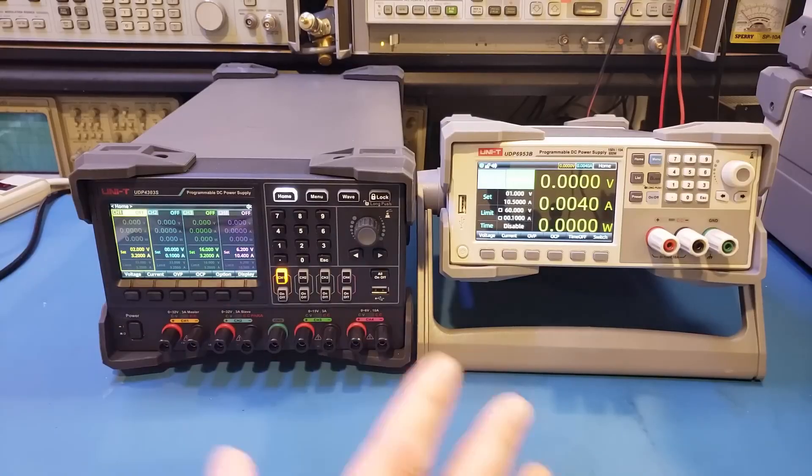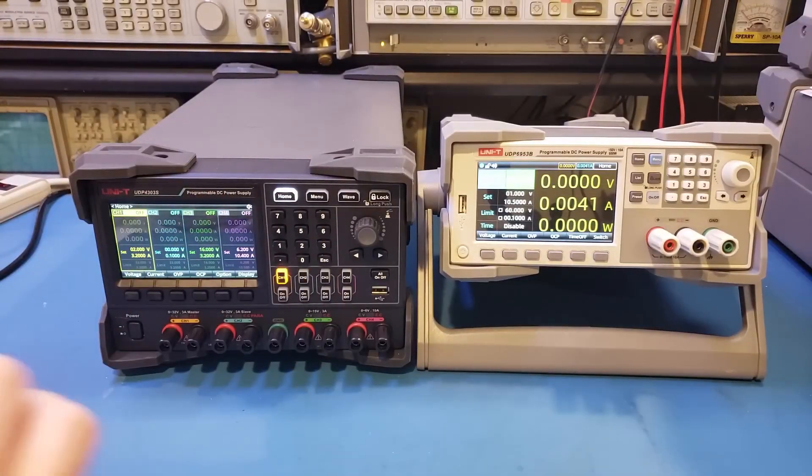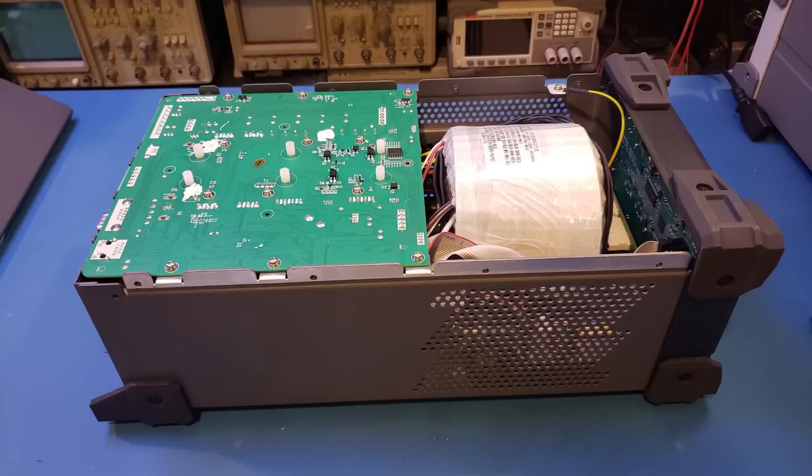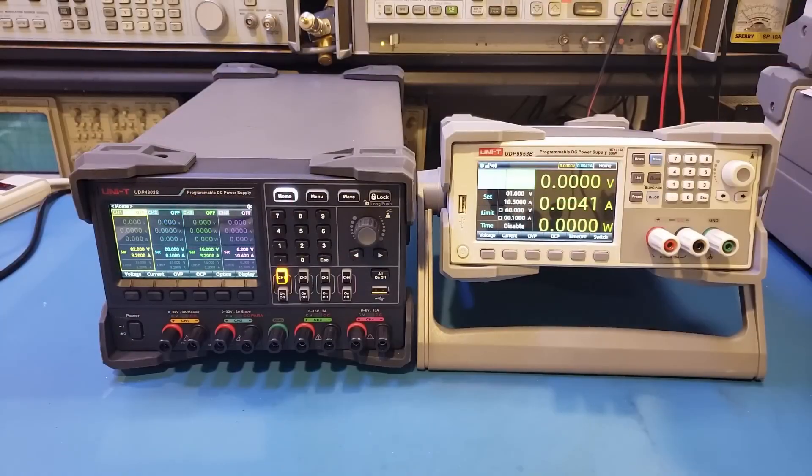From these simple descriptions, we can already see a few main differences. The first difference, which is quite obvious, is the weight of the power supply for similar output power. For a linear power supply, the mains voltage is stepped down via a mains frequency transformer. Because the mains frequency is relatively low, the transformer is much larger and heavier compared to the transformer used in a switching power supply, as the latter switches at a much higher frequency. Transformers can be made much smaller at higher frequencies because the core size and number of windings can be reduced while maintaining the same power transfer capability, since the magnetic flux needed to transfer the same power is inversely proportional to the operating frequency.